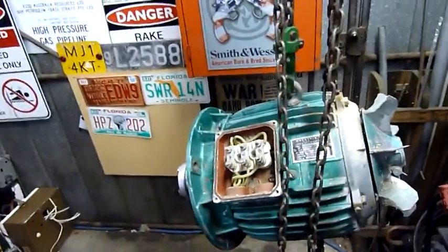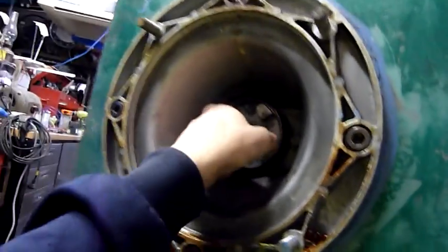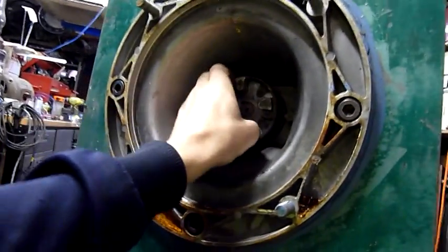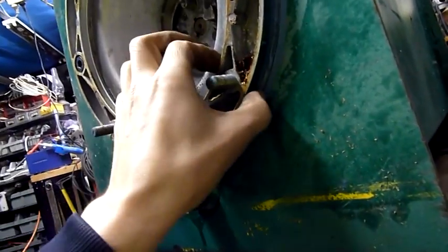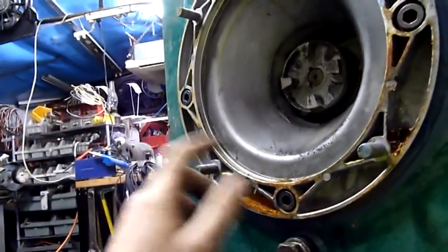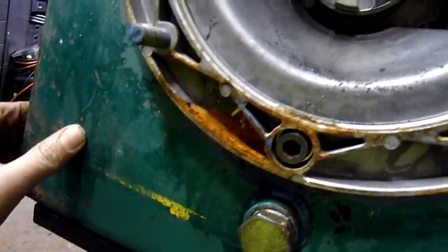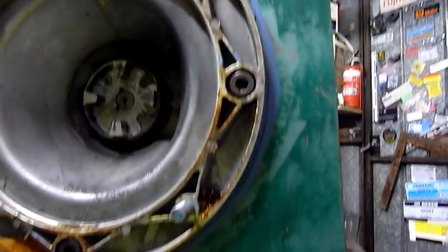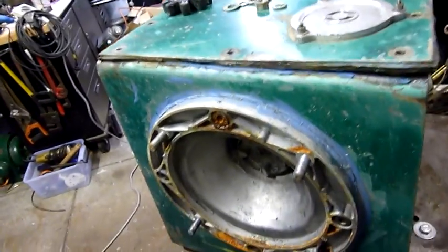The way the inside of that is just the other side of the coupling — the male side of the coupling. And these are threaded into the bell housing too, that's clamped it in there. We've got cap screws also holding it in, so it's completely sealed. There's no sign of oil getting through — just a bit of water. It's been out in the weather at some point, or probably even installed out in the weather permanently, and it's just had water get in. Not a big deal — clean it all up, away we go.